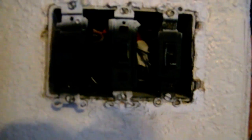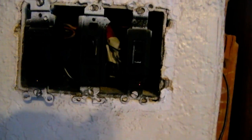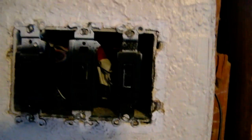Being it was by the front door, I was lucky enough to have 120-volt power right at the wall switches — a hot and a neutral that was on all the time. So I custom-modified one of those little switching power supplies; specifically it was a Linksys 12-volt switching adapter. We modified it to make it smaller so it would fit in there, insulated it, and that's what provides the power to the unit.